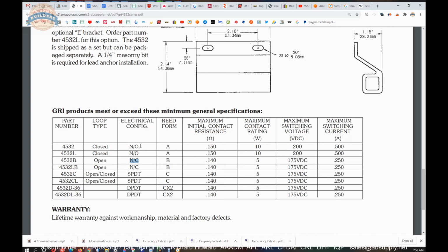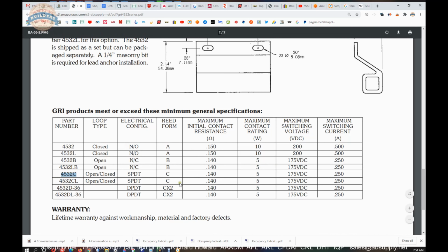When you bring the 2 pieces together, the circuit will be closed, allowing current to flow. And when you remove the 2 parts from each other, it will go to its natural state of being normally open. If you want to have the ability to do 2 different things based on open or closed, you could do a single switch. That would be single pole double throw.